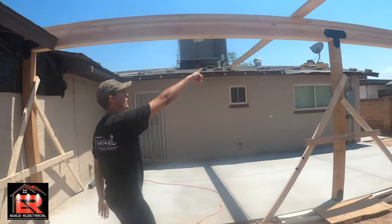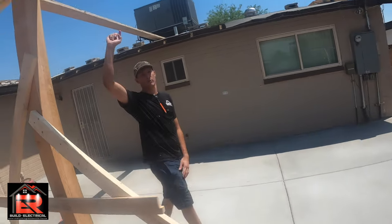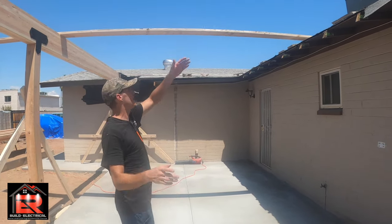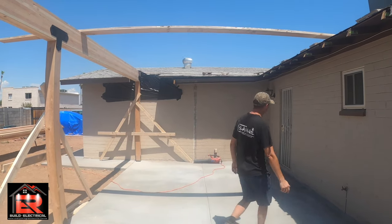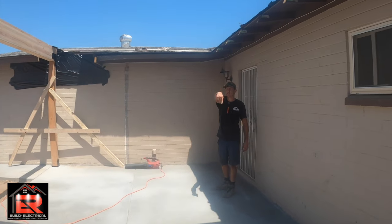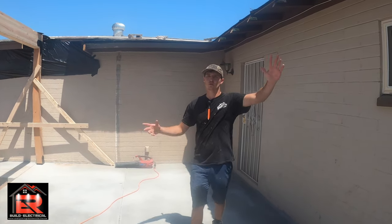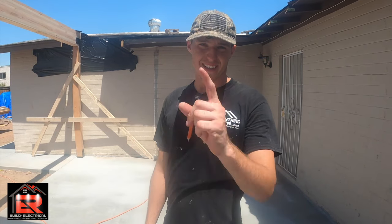Look how beautiful that hardware is all around — awesome. We're using two-by-eight rafters because it's a 14-foot span. It gives you an idea of how big it's going to be. When you walk out your door you don't want milled-in posts with a low ceiling — that's not right. Some people attach it to the fascia board; we're attaching it up off the roof, structurally done right. Tomorrow we'll be doing rafters.